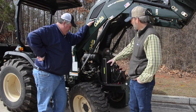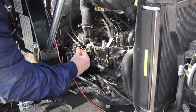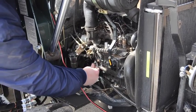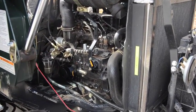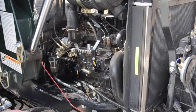Where do you check the oil and where's the filter on here? The dipstick is right here next to the oil filter — it's color-coded in yellow so you always know that it's oil. The oil filter is right beside it; it's a standard spin-on oil filter. There's also a fill point up on the top of the engine and a fill point on the side of the injector pump. I always top the injector pump off with a little bit of oil so it doesn't start dry.